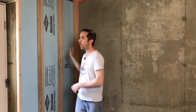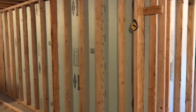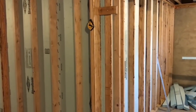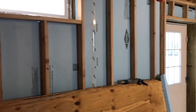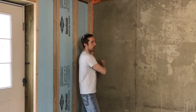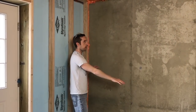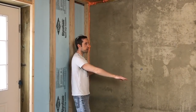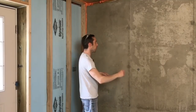So far I've got maybe a third of the basement framed in. I've got my door framed in, and later I'll end up pulling this door in so it's flush with the interior wall. I've got about four walls finished. In this video we're going to start here, go roughly half the wall down, laying down our pressure treated board, installing our XPS foam board, and then framing out the wall.